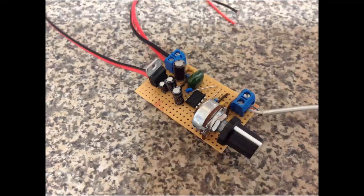So that's a close up. And it's great for, you can build really small with this kind of stuff. And if you've got pins, I mean, I soldered that little IC straight in, but you can buy the little holders if you're scared about applying too much heat to it, and then just solder the holder in and then plug the chip in afterwards if you want.